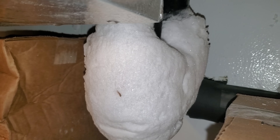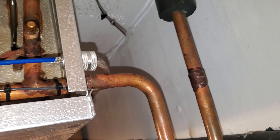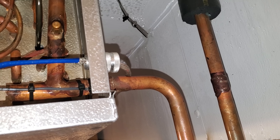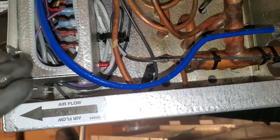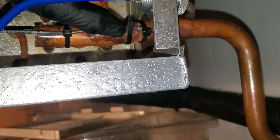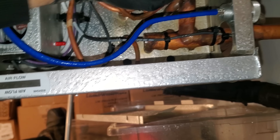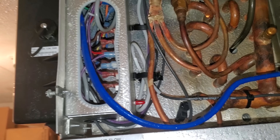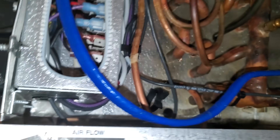There is a big old fat ball on the suction P-trap, which there's not a whole lot I can do about that right now because I don't have insulation. I went ahead and cut the P-trap off completely. I'm going to send someone to go get me some insulation and try to permanently fix that. More than likely, just from experience, we're going to have bad sensors in this coil. See how loose that sensor is? That's our suction temperature sensor, so that's going to fudge with the superheat, but it was insulated pretty well. I'm pretty confident we're going to have coil temperature sensors that are bad, because it was reading excessive defrosts. Since I have the coil apart, I'm just going to go ahead and change the sensor.